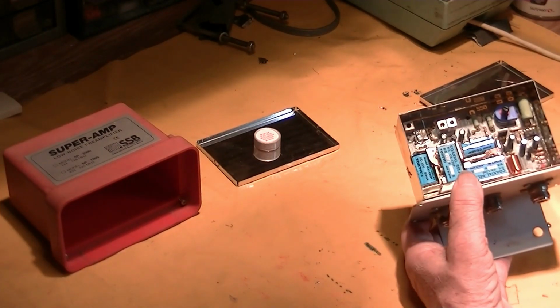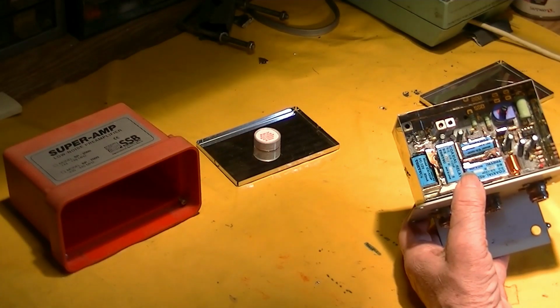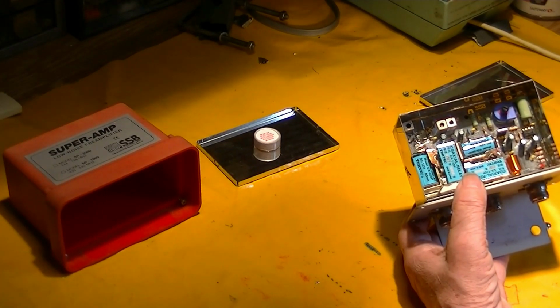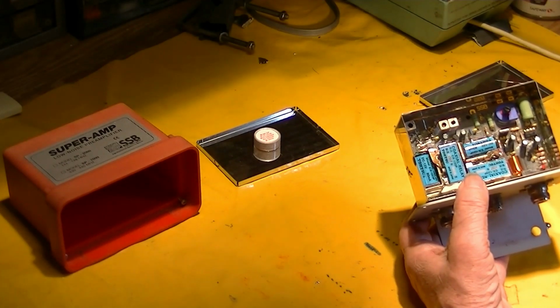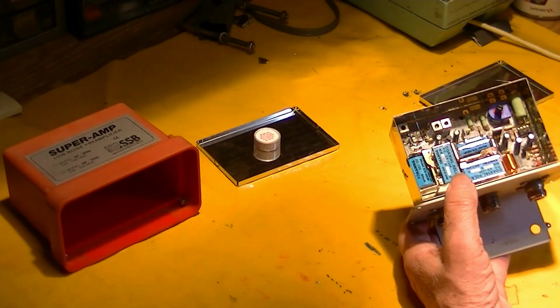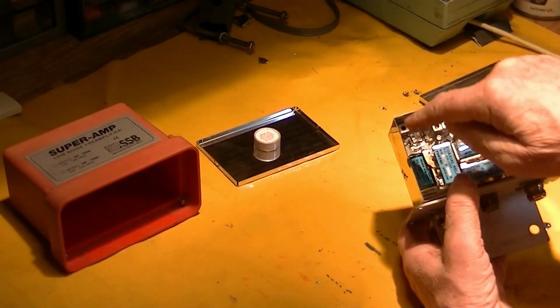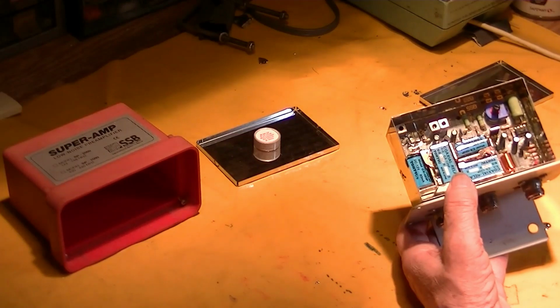I traded an ARR 144 VDG GaAsFET preamp, which was nice. It had a half dB noise figure like this does, and it would RF switch 25 watts, but they don't have a reputation for being very good in strong RF environments, because I think they don't have this tuned bandpass filter in the front end to protect them, but that's surmise.